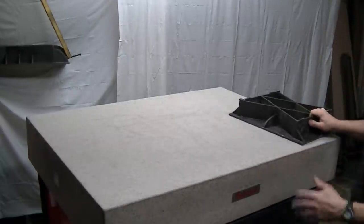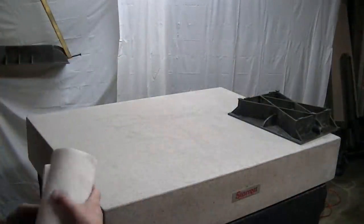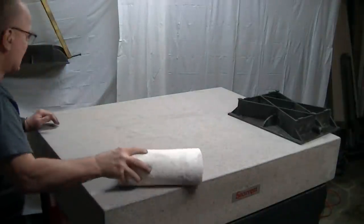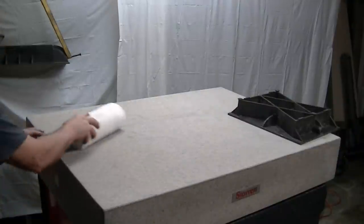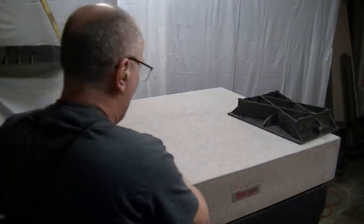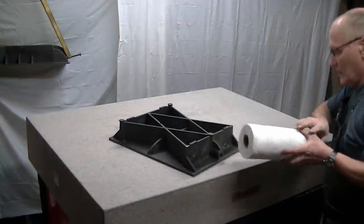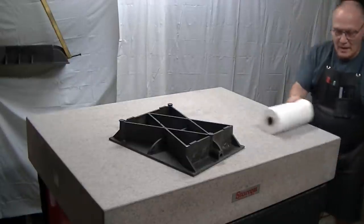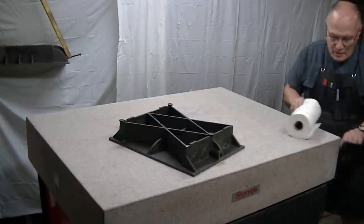That is cutting nice. The iron plates would have been choking and getting sticky by now. And this is just feeling very uniform. I've got to be careful not to assume that this is removing material as slowly as before and end up going convex. I know I'm pretty severely concave, so I'm going to take another pass around.